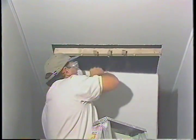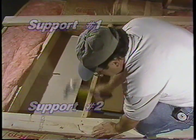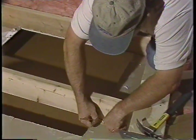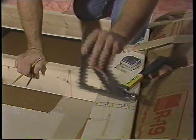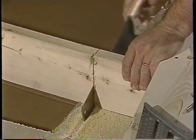If you choose a cut joist installation, this is how it is done. If you have chosen the no-cut joist installation, please be patient for a few moments while we review the joist removal technique. Nail or screw two temporary supports at each end of the opening, angled to allow room for proper sawing — this will help prevent sheetrock cracking. A two-inch by six-inch piece of lumber will be fine; the bridge boards should overlap the joist by about six inches. It is important to recess your cut by one and one-half inches from the edge of the shutter opening. It is also important that the joist be cut perpendicular to permit a snug fit of the header to the joist and a flush fit to the edge of the shutter opening. This is critical to ensure the shutter vanes don't rattle.